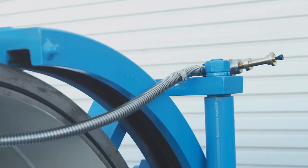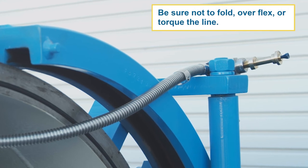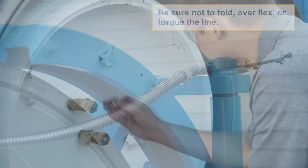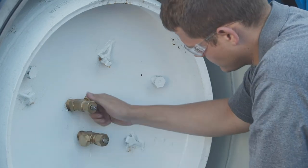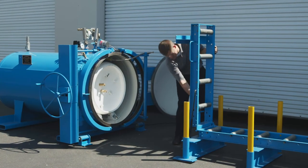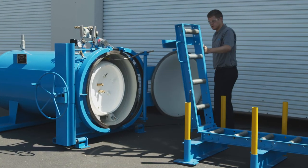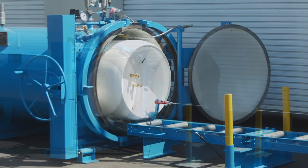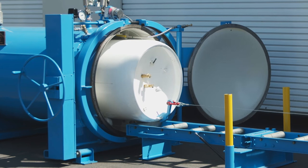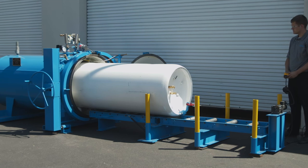Place the interior supply line out of the way, making sure not to fold, overflex, or torque the line. Install a cap on the interior gas supply valve, making sure the cap has only one gasket. If you have a fixed loader, detach the drop-down roller section. If you have a movable loader, position the loader into place. Remove the empty ton cylinder from the Clortainer using the automatic winch. Now you're ready to load the full cylinder for process.